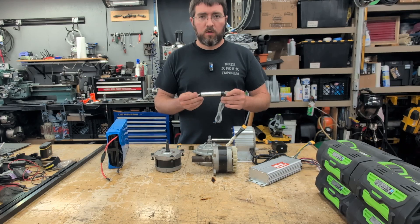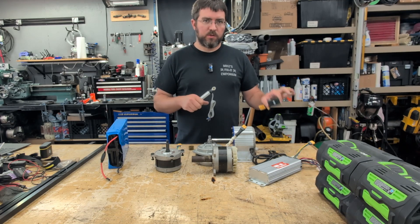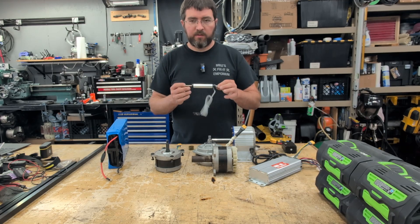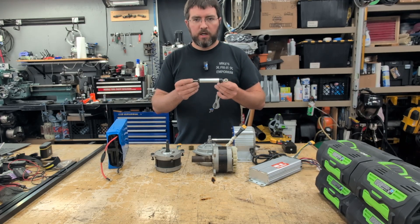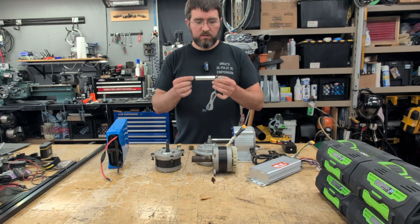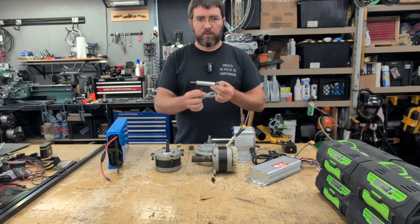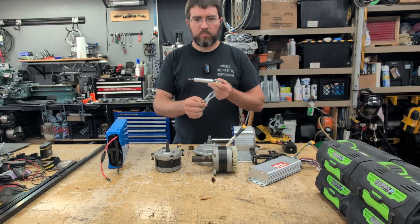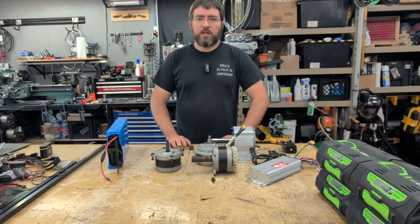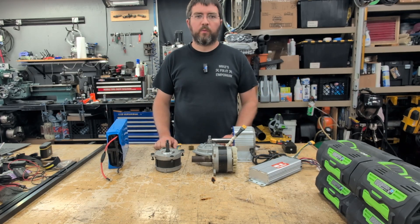The only other thing I needed to do was take the steering input from the sticks and map them into the VESC controllers. To do that, I used linear displacement sensors — they're made for injection molding automation, and it's just a linear 5 kilo-ohm potentiometer that detects how far the stick is out by reading a voltage on the output. I connected one of those to the stick on each side, programmed the controller with the min, max, and center values, and we were ready to rip.